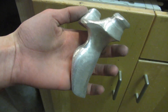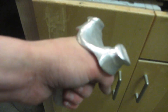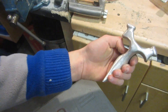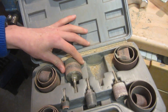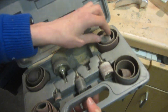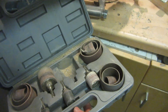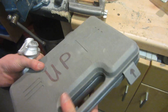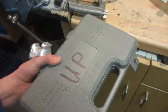After filing and shaping there are barely any imperfections in the surface — apart from one that's a little deep which I could remove but it might distort the shape, and two small ones on the side that should blend into the final appearance. It's pretty much symmetrical, looks quite nice, and fits into my hand really well, with all the rounded parts rounded. To remove the deep scratches left by filing, I'm using a set of rotary sanding drums in a regular power drill. These were only a couple of pounds off Amazon, but if you don't want to use them you could also use a piece of sandpaper wrapped around a wooden dowel.